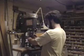Alright, so the general idea of how this is going to work, I'm going to try and see if I can drill out these bolts, what's left of them, and I'm going to start by switching from the bit that's in here to a smaller bit and work my way up. The idea is to start small and then progressively ream out the smaller hole that you've got.